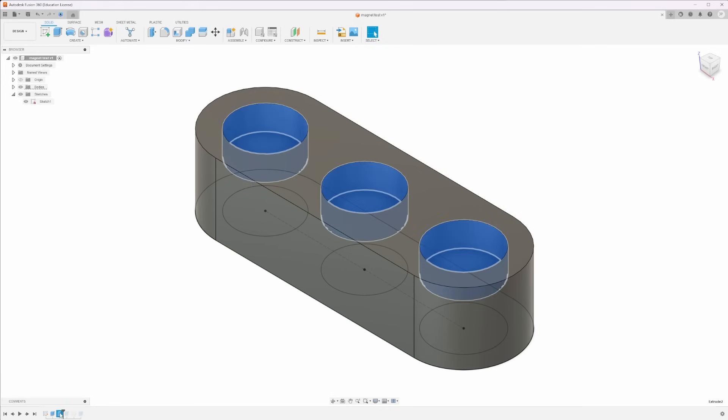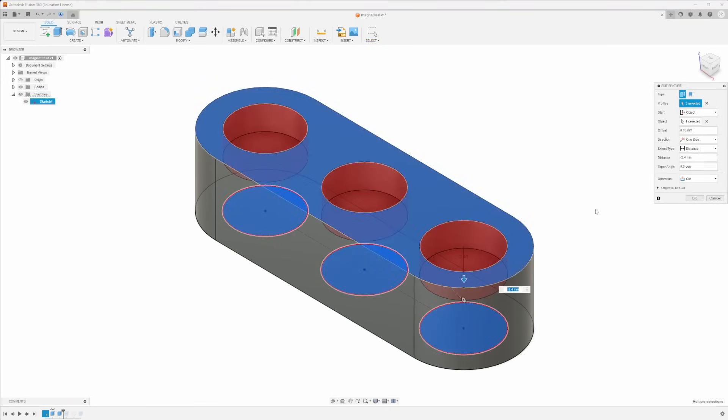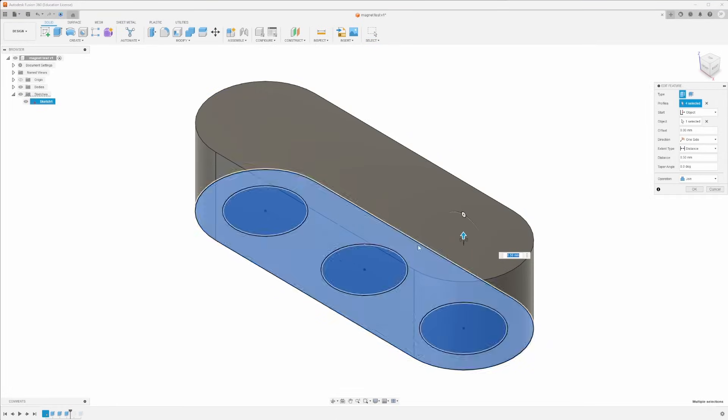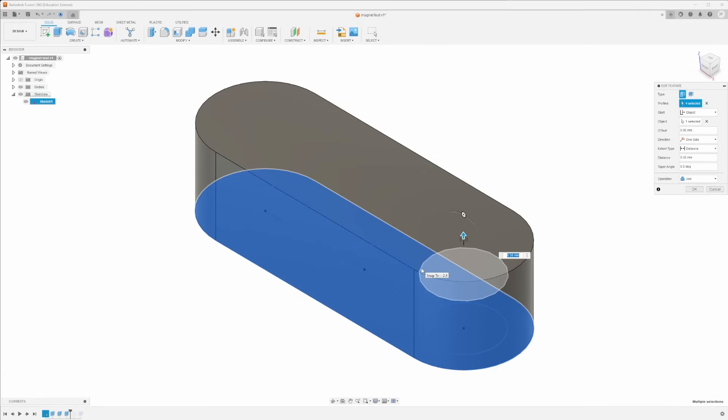The next stage is I've used the first sketch to cut, making a cut of negative 2.4mm. The magnet only has a height of 2mm but with the nature of 3D printing you want a bit of extra space just in case. You don't want the tool head scratching over the magnet if it's sticking out too much, but obviously not too far or the magnets won't attract each other. I recommend either 0.4 or 0.5mm extra — in this case I've done 2.4mm for the cut. Then I've extruded a 0.5mm wall on top, and when printing over the magnet I recommend at least two layers, so at 0.2mm layer height that's 0.4mm of space.